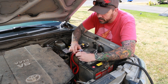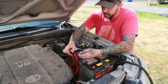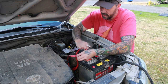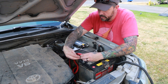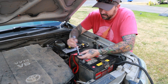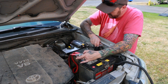We'll loosen that and remove the terminal, since this will now be relocated to the fuse block. You want to remember that you're going to be coming off in this direction. I'm going to go off the inside here — we'll get that attached on the inside, get our starter cable back on there and get that threaded back on and tightened up. Now we have everything connected, so we can go ahead and hook it back up.